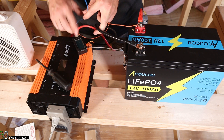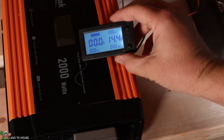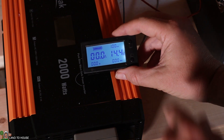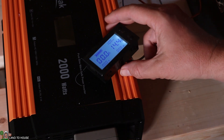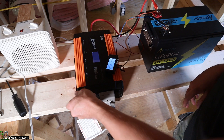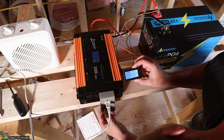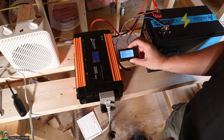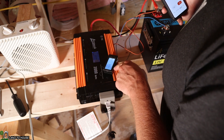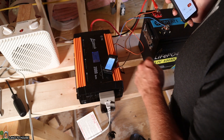I'm going to take my negative lead on my meter and get that set up. If we take a look at this meter, you can see it says 14.4 volts on the battery and everything else has been zeroed out except for 100 amp hours, which is important for us to see how much this battery has. I'll go ahead and flip on my inverter. I'm going to reset my kilowatt meter. Now I'm going to get my stopwatch ready and turn on the load. On setting number one we've got 660 watts. Setting number two, we've got 980 watts.